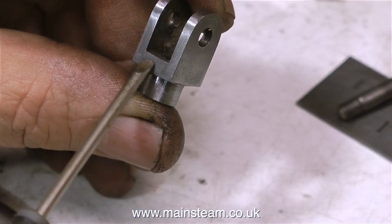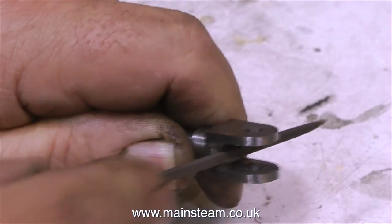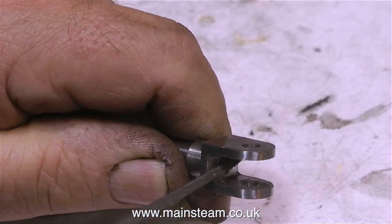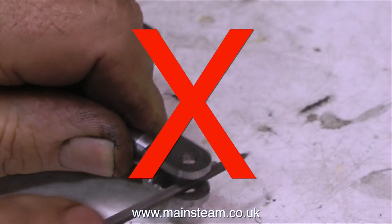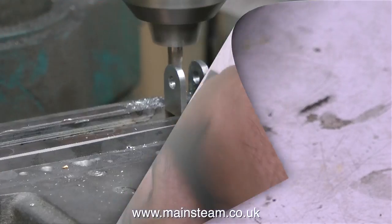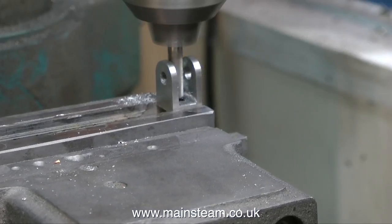Here's the problem - there is too much metal in this part of the valve fork, so I'm going to remove it. I'm going to do it the quick and easy way using a file, because I can't wait to see the engine run and I need to get it back together as fast as possible. Well, it does sort of work but it looks horrendous - I'm going to do it properly. I filed it first just to demonstrate that it mustn't be done this way - it's just a bodge.